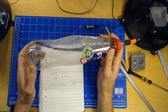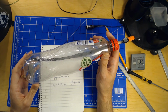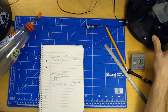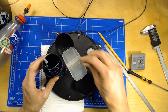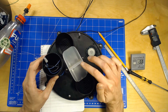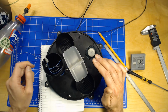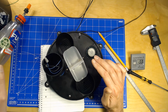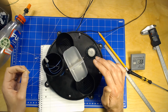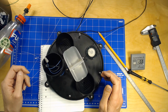Typically, you shouldn't be able to empty this bottle faster than maybe 20 minutes. So 20 minutes, half an hour, is quite an optimal rate, because as you can imagine, if it goes really fast and you have tips going like crazy here, you will lose quite a lot of pulses, because it's just going to pour water everywhere if it's going too fast. There is some protection for that in the funnel of the hardware here, but it still is not enough. So if it goes too fast, you will lose pulses, and water goes places it's not really designed for.